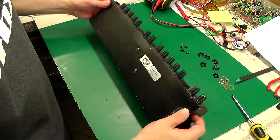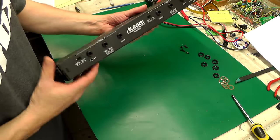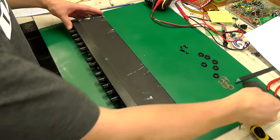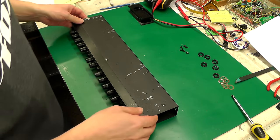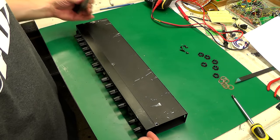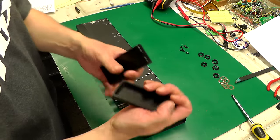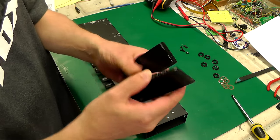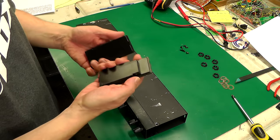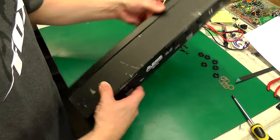Let's open it up. I've already removed the screws — three on the top and three on the bottom — and I've removed the nuts on the back of the connectors, the quarter inch jacks. The sides come off. These things are designed to be rack mounted and they come with lugs at the ends for that. I'd actually removed them — hacked them off — because it looked unsightly below the TV; I'd rather have a box format for sitting there.